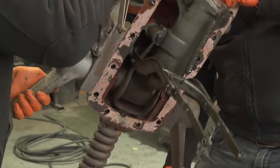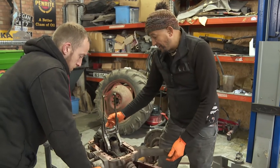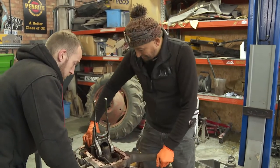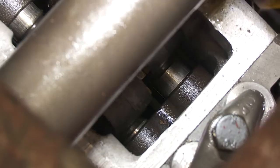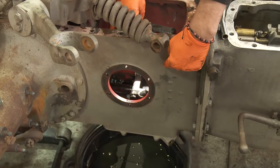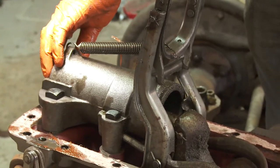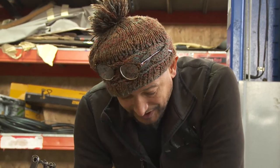Let's tip it upside down. Here we have a hydraulic piston which, under the influence of hydraulic fluid being pumped into it, pushes the piston down and therefore moves these lever arms which are attached at this link here. But it seems quite seized up at the moment. Looking down here I can see the shaft that comes through and operates the hydraulic pump. There are four pistons on this hydraulic pump, all moving in and out and pumping hydraulic fluid up a tube which runs on the inside of this casing, up through this hole and into this orifice, through drillings, into the back of this cylinder, and pushes on the piston which pushes it down. I can see that the pistons are scored, which means they're not going to be working as efficiently as they should, or maybe not even at all.